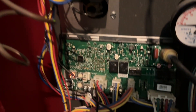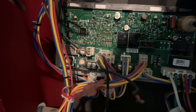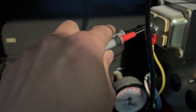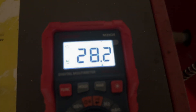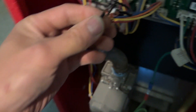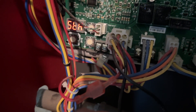I'm turning the boiler back on and the board is saying everything is okay. I want to make sure the transformer is working — I got 24 volts, so that's fine. I have the thermostat disconnected and I'm jumping out the R and W, but the boiler is not responding.